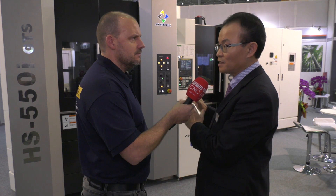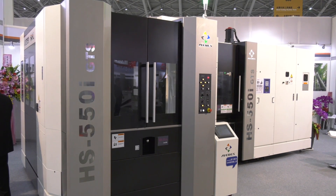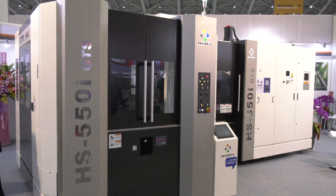And it is incredibly fast seeing this machine move around. You need quite a solid construction, don't you, so there's no vibration. Have you built that into this? Yes, the rigidity and the speed have to come together — otherwise it means nothing. So this machine is built with very robust casting and very good components, a well-built machine, so it can go up to very high speed. Where are they built? We have major components all made in Japan — that's how we can build a machine more rigid.